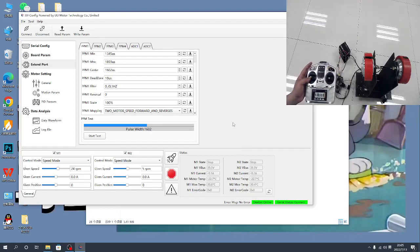One important thing: before you turn on the transmitter, be aware the motor may run. If you power the motor controller first, the motor will start running. So you must disable the controller first, and then power on the transmitter.